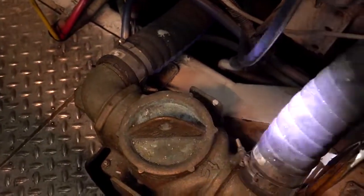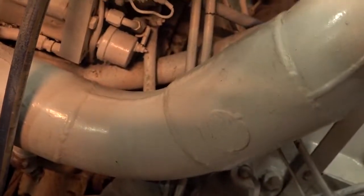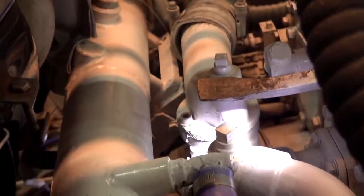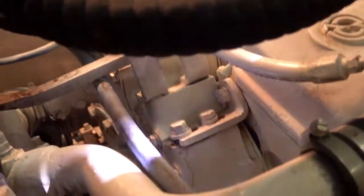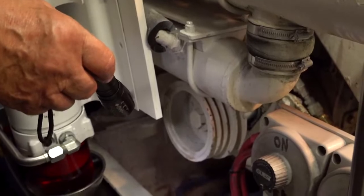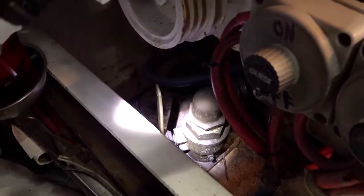This is where your sea water comes in — there are raw water pumps we were talking about with the zincs. Underneath the front of the engine there is a valve, and you can probably see the port one. That valve is open; it goes through the sea strainer and into the raw water pump, which is right here on top. That supplies sea water which cools the heat exchanger. This is the seacock — it's open right now; when it's perpendicular to the opening it's closed. That is what feeds the sea strainers here — the sea water for cooling.